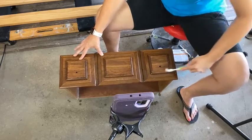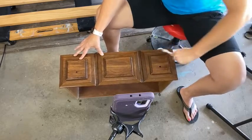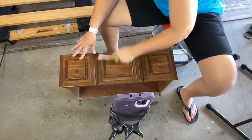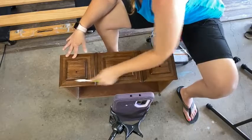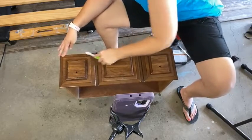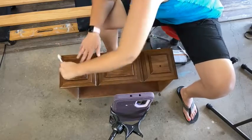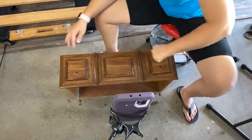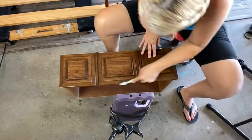If you have a really old piece with a lot of debris in here, when you start painting, you're gonna spread that debris around with your paintbrush, and in those places, your paint is not gonna stick over time. It'll start just kind of chipping off. I mean, that works great if you're going for a chippy finish. I still think you want to clean it and achieve that another way so it's more controlled. So that's why you want to do this.